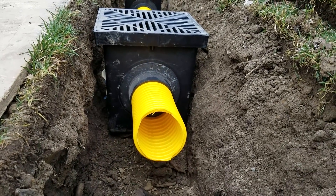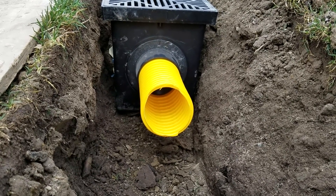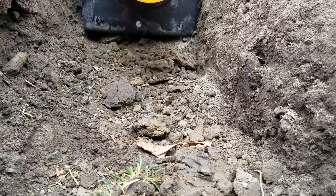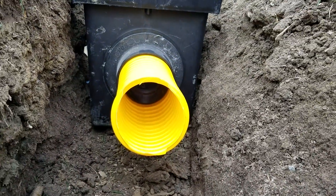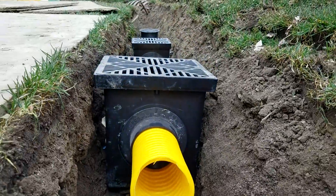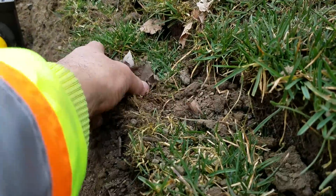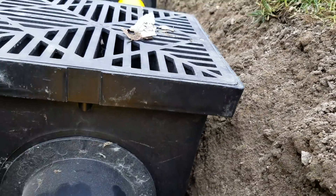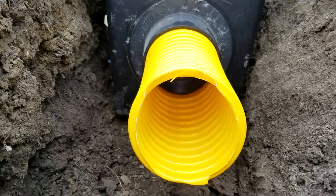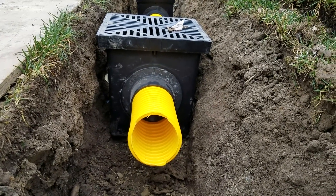Most of what I see is a four-inch inlet and a six-inch inlet, but let's give them the benefit of the doubt — this is a 12 by 12. Notice how it leaves all the water in the bottom of your French drain system or yard drainage system. Nobody ever wants to talk about this. When water runs in here, leaves and debris go in, and since this is directly tied to the pipe, those leaves float and fill the pipe, break down, and become topsoil organic material.